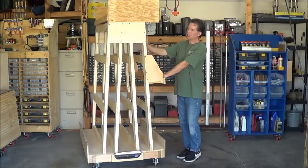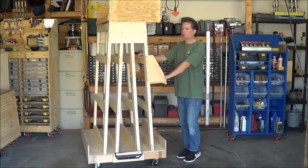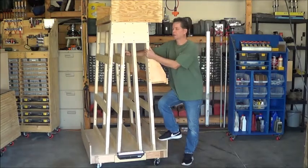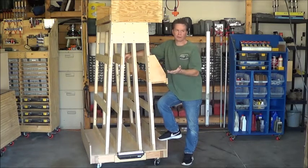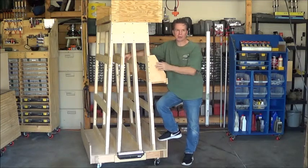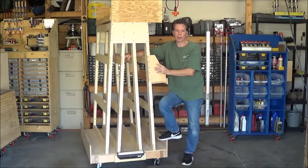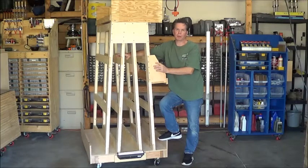All of the uprights and cross members I decided to put through the thickness planer. I took them down from the typical 1.5 inches down to about 1.25 inches. That gave me an extra inch of storage space, because a 1/4 inch from each of the four adds up to an extra inch of width in place where I can add sheet goods. So that was sort of a side benefit of putting things through the thickness planer.